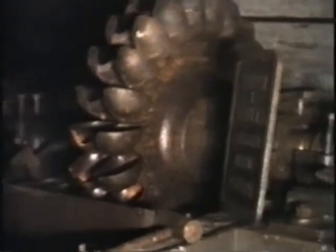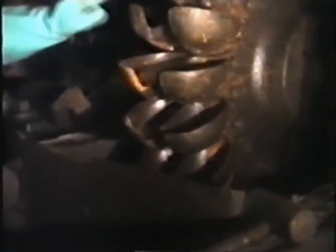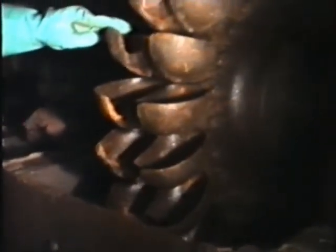There was also a Sullivan compressor in this place, but how it worked was that the water comes into the Pelton wheel through a very fine jet, which can be adjusted either with a fast flow or a slow flow, and it turned the wheel round, which in turn turned the compressor. This plant operated at very little cost. Once the initial installation was paid for, it cost nothing to run it because the water was free off the fellside.